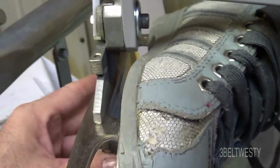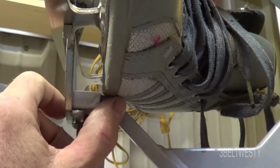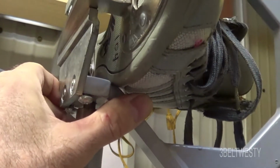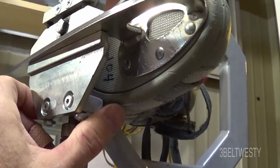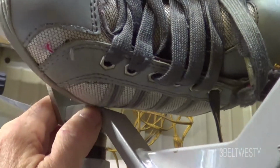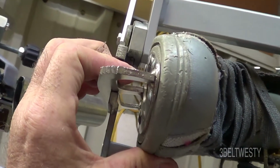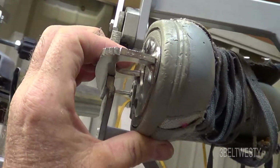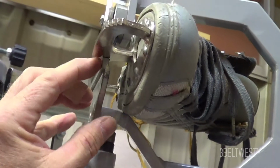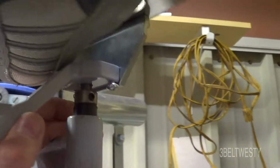So here on a swing arm machine, I actually had it just barely touching over here. And what happens, you might go through a bunch of skates that are a certain size and never have it touch anything, but I just barely kissed this a little bit here, and so this is actually tilted up in the holder like this. So that's something to be aware of, that it's purely just clamping the blade and not touching any little feature on the skate.